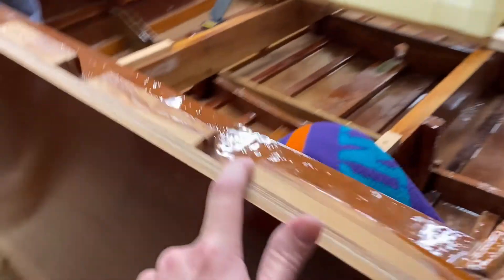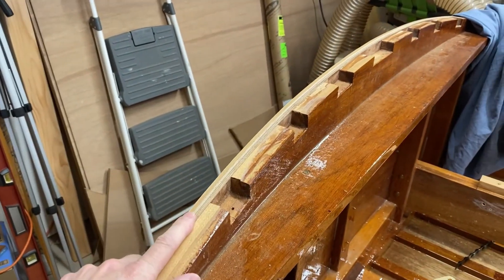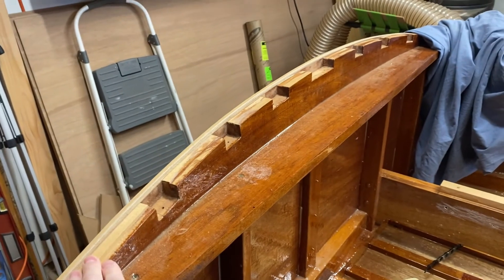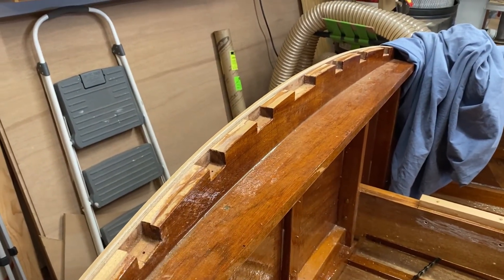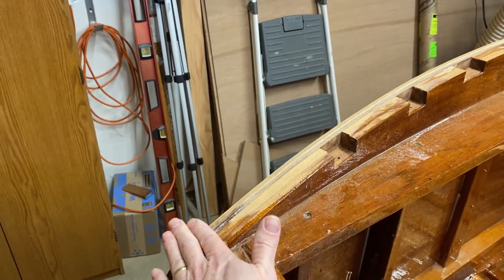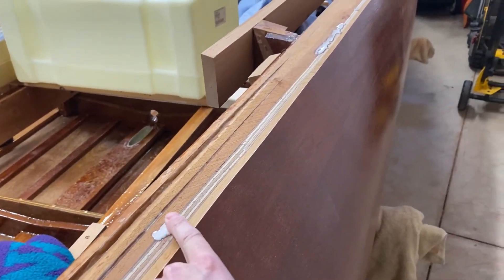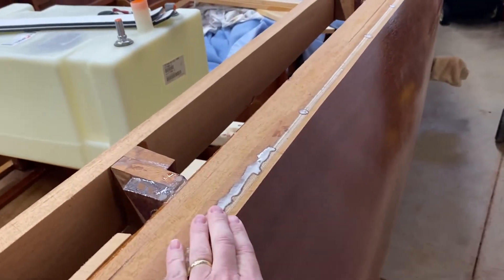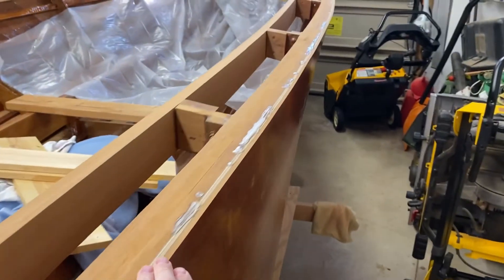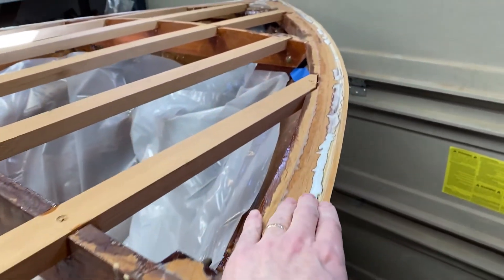I had talked about this back piece — the picture I showed earlier only had the outer planking layers. I didn't have these two laminations of half inch which the plans call for. That's where the back deck battens will fit into these notches. This is all fared off now, so you can see the idea is you want it to continue right out to the outer edge. You can see some epoxy spots from where I filled those small gaps — up front I had some gaps in my planking that I wanted to get filled in so they'd be nice and solid.